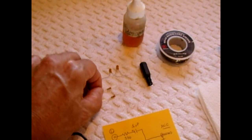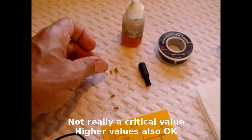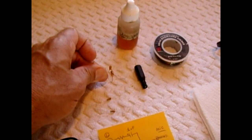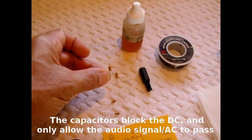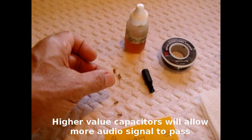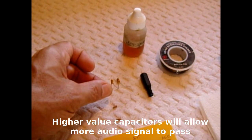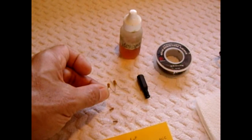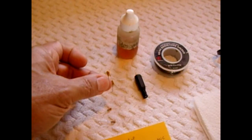You're going to need two 1/4 watt 330 ohm resistors and two 1µF capacitors. They don't have to be electrolytic — I used dipped tantalum capacitors because they are very small for their capacitance. Ideally use a nonpolar 1µF, but electrolytic or tantalum 1µF capacitors work if you're looking to save space.